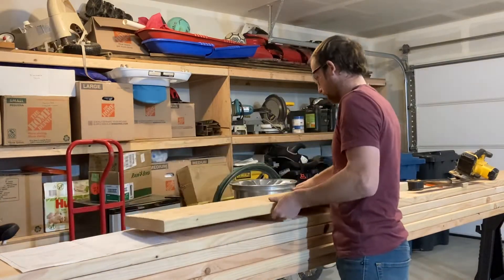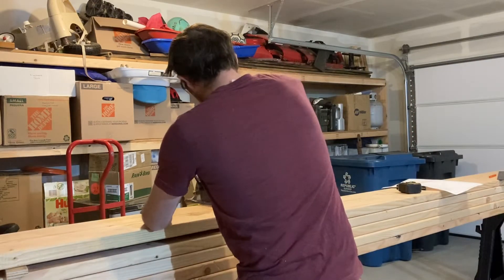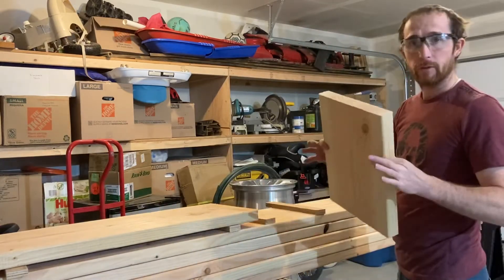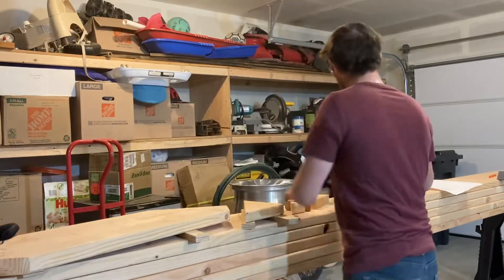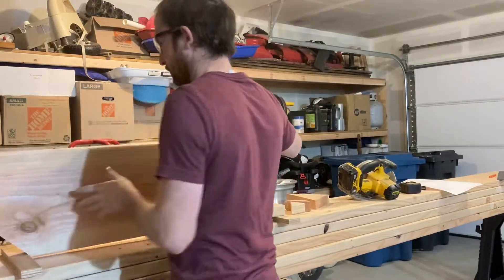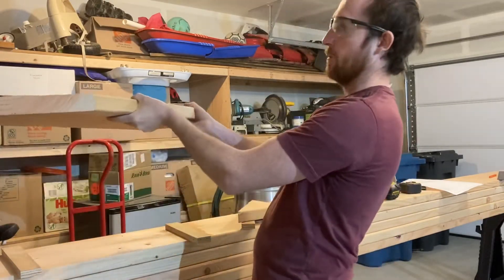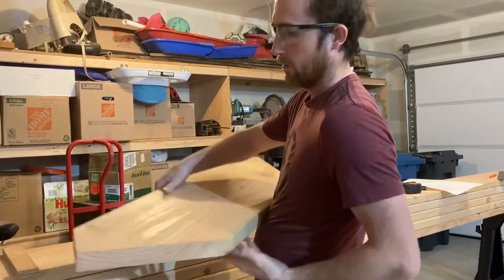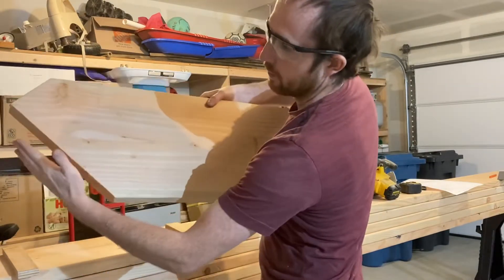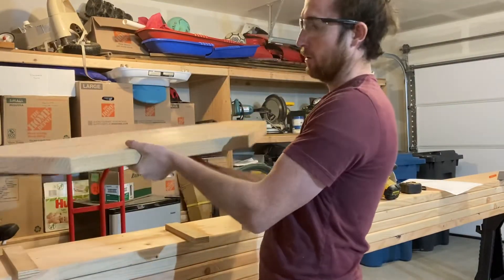I'm going to go ahead and mark that out. There you have your corner board marked. This is the front of the shelf, this is what goes back in the corner, this right here sits on a bracket, this one here sits on a bracket, right in the corner. And that will actually go flush with the back so the boards go the other direction. It will make more sense when we put them up. I'm going to do a test piece for the corner. This corner board sits about like that — post here, post here, post that goes here, wall is here, wall is here. So it will sit in there just like that.